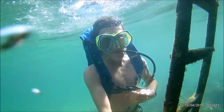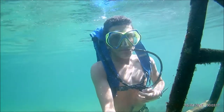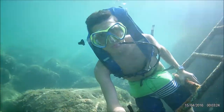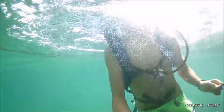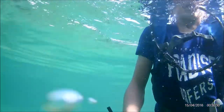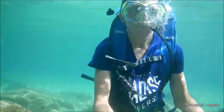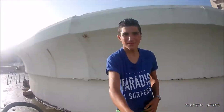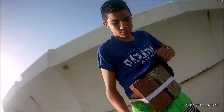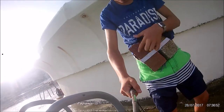It works, but there is a major flaw — to stay underwater I had to latch onto the ladder, because I forgot a very important thing: since there is air in the bottles they become buoyant, so we need weights to overcome that force. Around 5 to 7 kilograms should do it. A day later I went back to the beach with small bricks as weights, which worked but wasn't perfect as the bricks slipped out of my shirt. So I wrapped velcro around the bricks and another piece of velcro around my waist, and attached the bricks to my waist — and it was ready to go.